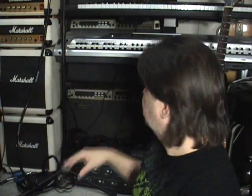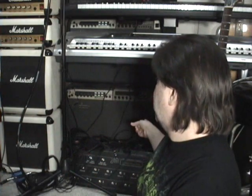That cabinet can be one 8-ohm speaker, or it can be one cabinet with four 8-ohm speakers in it, but still wired so that the whole cabinet is 8 ohms. So I can run two more 412 cabinets off of that amp, as long as they're both an 8-ohm rating. I'm just not mixing and matching ratings. I'm not running a 4-ohm cabinet and then a 2-ohm cabinet, and whatever. So I'm keeping with 8 ohms and 8 ohms. That's an 8-ohm speaker, that's an 8-ohm speaker.